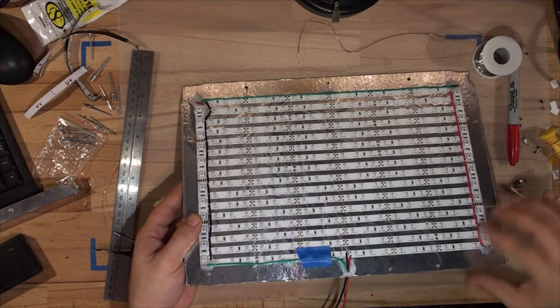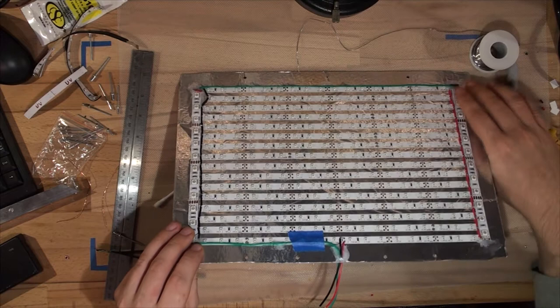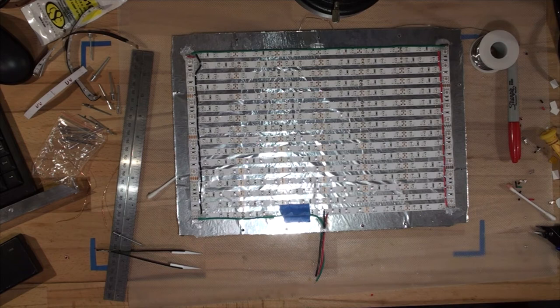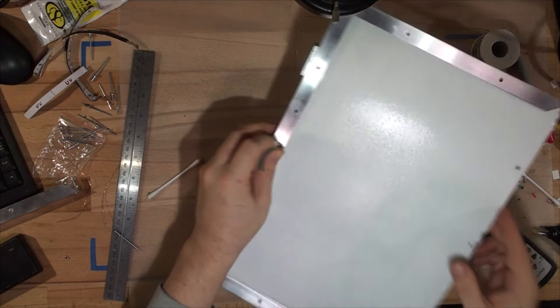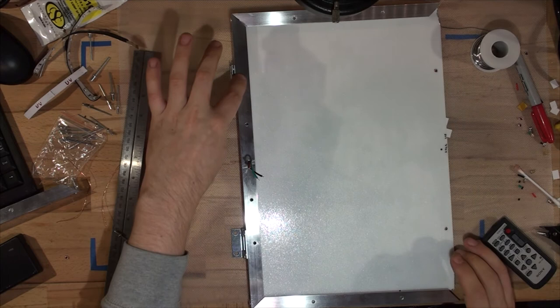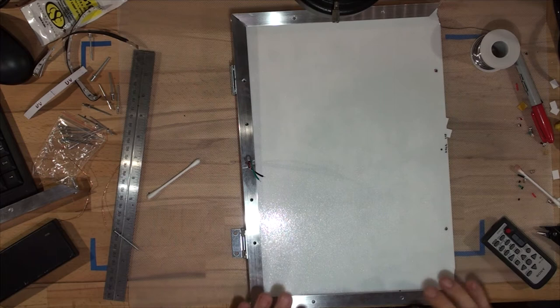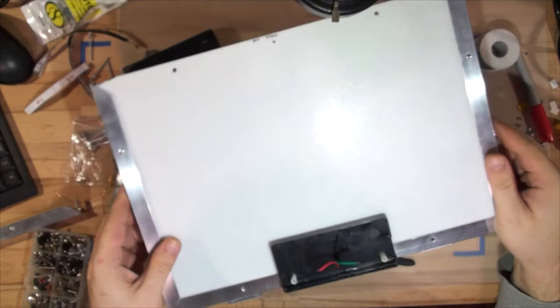The panel is now complete. I've added non-acidic silicone to hold the wires in place and to ensure the LED strips won't unstick in the corners. Now we're fitting the panel into the frame — insert the panel, feed the wires through, then staple the panel down. Do not staple the spring parts yet — just staple those four points and attach the project box on top with screws. Leave the spring holes alone for now. I'll rivet the aluminium and box to the frame with the LEDs.